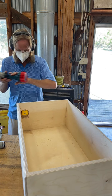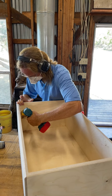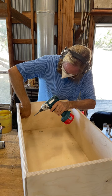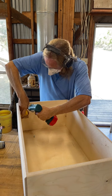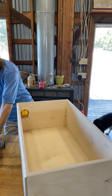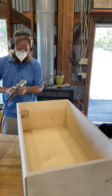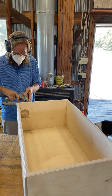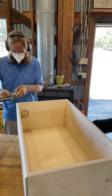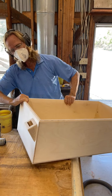And then I'm going to push real hard while I remove these screws. And I want to take this Anderson connector out. It needs to not be in there when I'm applying finish anyway. But I'm also going to snug fit. I'm also going to put a couple of pin tacks here where they're hidden to help hold it while the glue dries. Glue's doing all the work. Okay, that part's done. Looks like this.